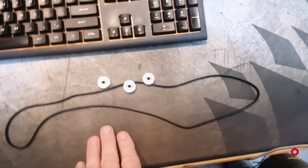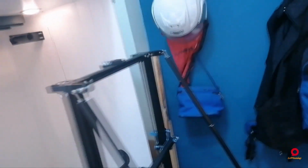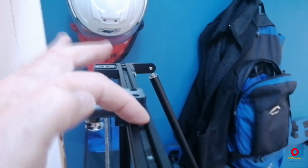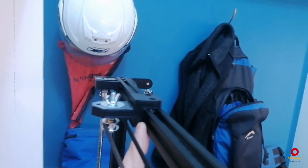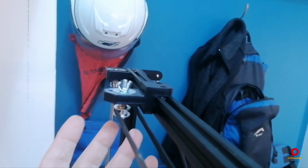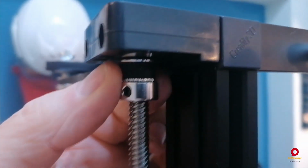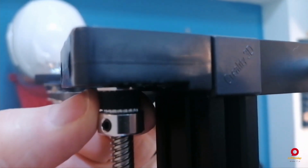So I'm going to take you guys along for the design of the bracket that's going to go onto this. We're going to keep more or less the same features as this bracket has. It has recessed holes for the screws to go through. It ties into this profile just with two screws, and it uses a kick plate method at the back to push against the back of this profile. Now with the amount of tension that's going to be on here, you do not have to tighten it so tight that you actually force these lead screws into a certain direction. All you want is this belt going around and making contact with as many of these teeth as possible. That's going to stop the belt from slipping. So after that lengthy explanation, I do hope that it makes sense.